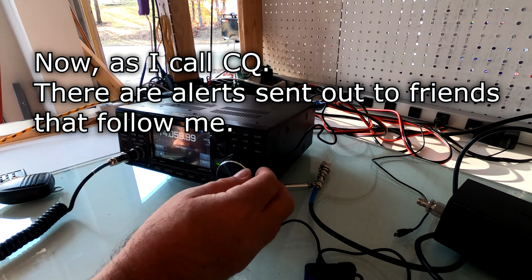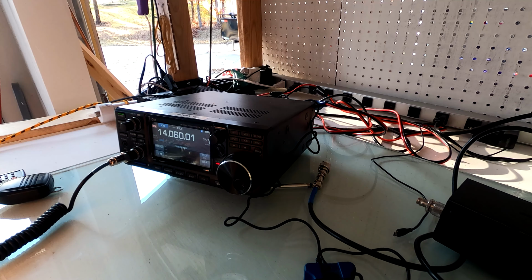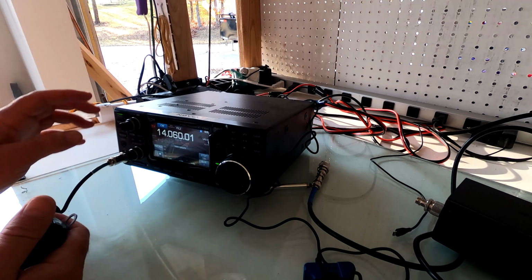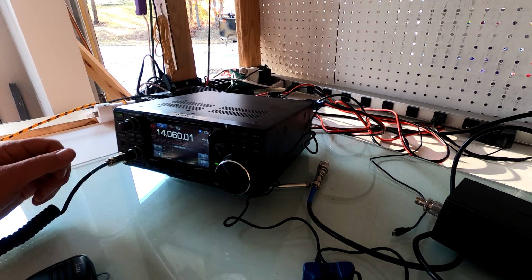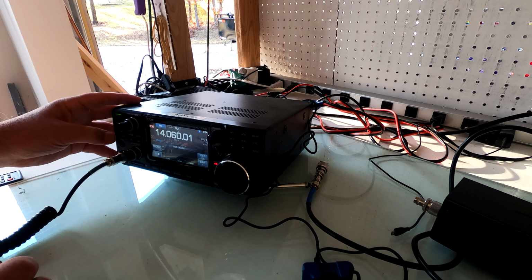First of all, we gotta put a little power into it. I'm gonna raise it up to about 10 watts. Now I can see the SWR. I wasn't running enough power through this, so it actually does have about a 3 SWR. So using the tuner there, and about 8 watts. There we go.